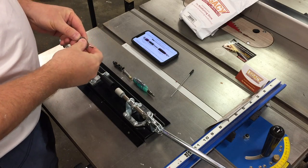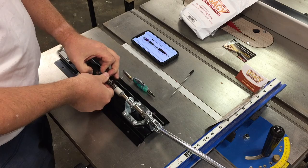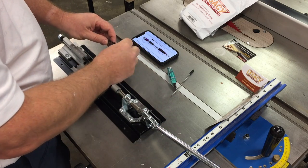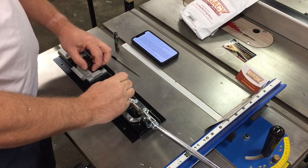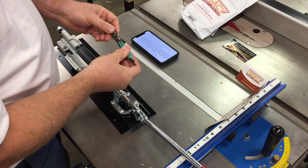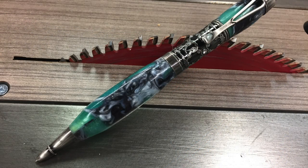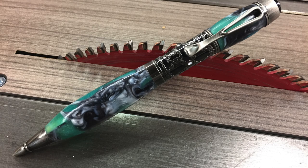For assembly I'm using my Milescraft 7-4700 pen press. I bought it because the reviews were quite high and I'm completely satisfied — I like the adjustability of different lengths, it's spring-loaded so it always comes back to where you need it, and because of the length of that arm you get a lot of sensitivity in the compression pressure. That's very important with this kit because the manufacturer, Legacy, requires you to press the pen transmission into the lower section to a length of somewhere between three-quarters of an inch and 13/16 of an inch. If you don't do it right the pen doesn't function properly. And there we go — all done! I hope you liked that video, please subscribe if you did, and I'll see you again real soon.